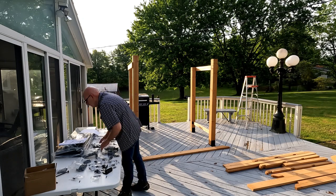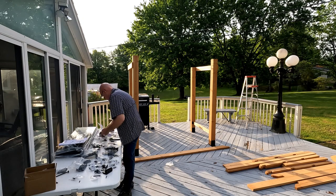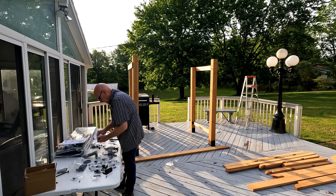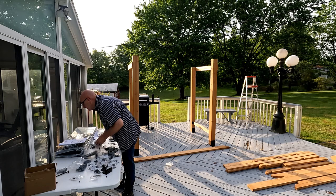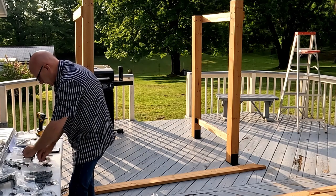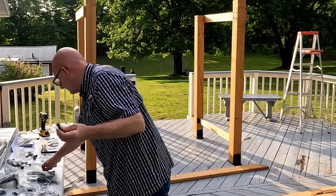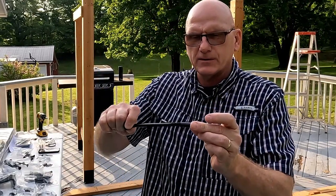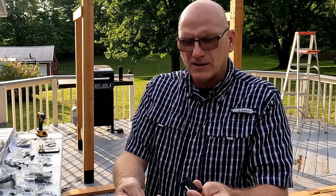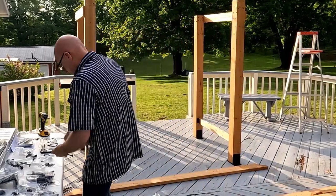Now, the 5/8 barrel nuts, 1.5 barrel nuts. I'll need 8 of those, and they will need the other washers on them. I don't know if I clearly point this out: the barrel nuts obviously have a larger diameter than the bolt. So the smaller washers I keep referring to have the smaller diameter go on these bolts. Larger diameter washers fit around the larger diameter barrel nuts. So, 8 of these.